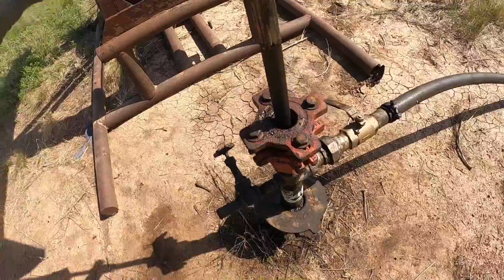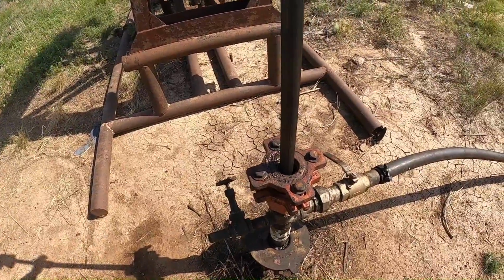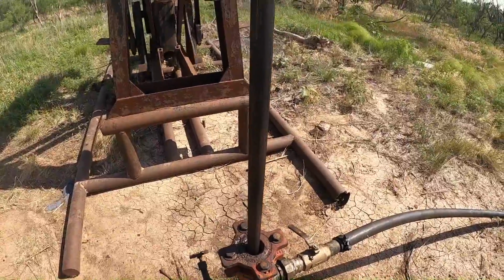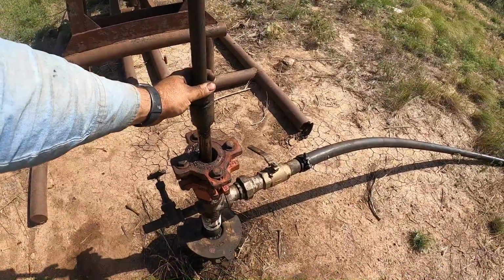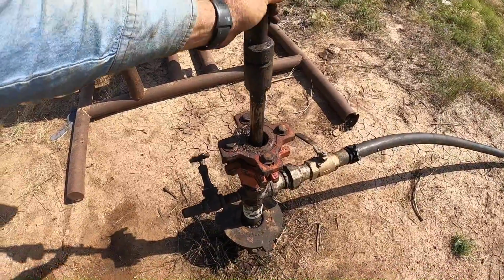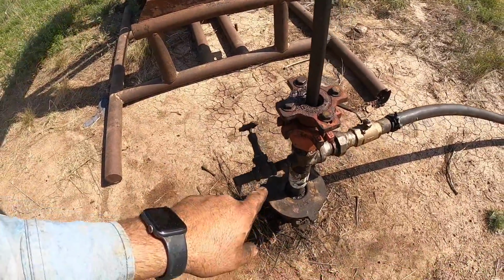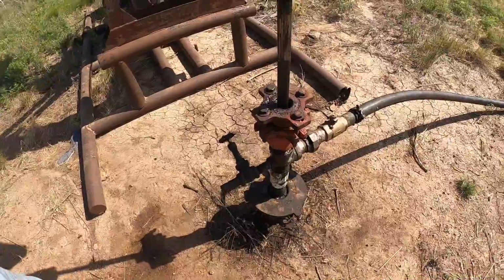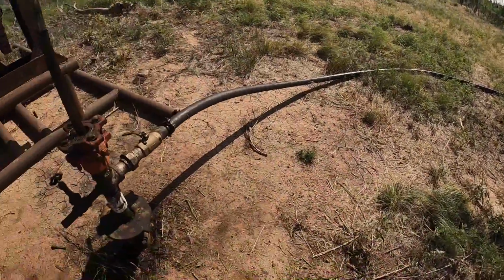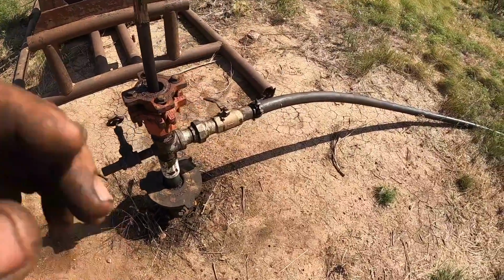It's possible it's gas locked, which means that there's gas pressure down there holding the fluid back, and this is actually pumping a full stroke, but the top part is gas and only the bottom is liquid. We don't really know, but anyway, I'm going to go back to town and get a 1/8 bleeder valve. We'll let this run for an hour, and I'm going to get my F-150 and get out of this turd, and then we'll come back out here and take a look at it.